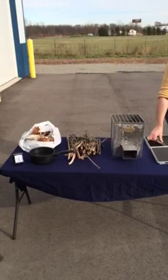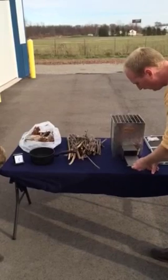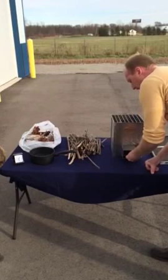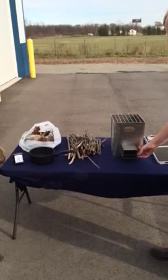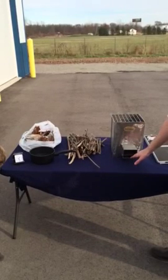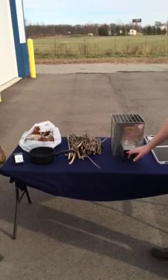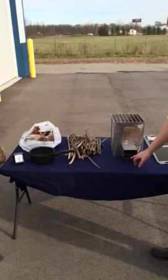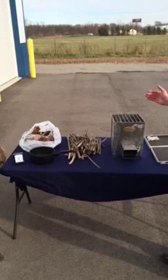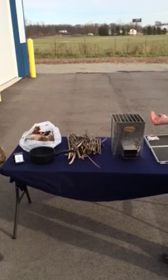Okay, and now here's your separator plate. Again, same material, 16 gauge 304. And what you do is you slide it through the front of the feed tube, and then you make sure it gets into the catch at the front of the chimney. There's a catch that holds it up there. So what you have is an independent draw for the air into the heart of the combustion chamber, so it's not going to get choked out by the fuel that's in there. So the fuel goes on top, the air is supplied through the bottom, and then the whole thing just has this kind of L shape, which a lot of rocket stoves have, and that's the whole point. It has a continuous draw of air, and then all the heat goes straight up into your pot.